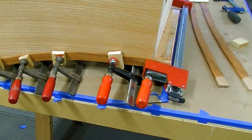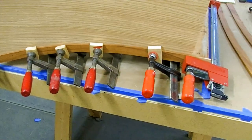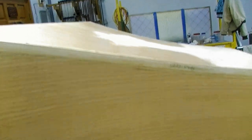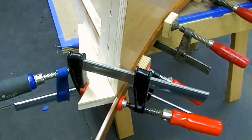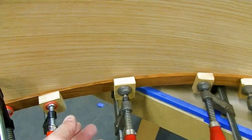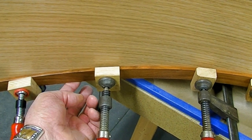After bending this little strip here, like you saw, I'm doing a dry fit with just clamps, no glue yet. I'm able to clamp these. The back side I'm able to do because it's hollow and I'm able to get the clamps around this edge. This top part's going to be another story. But to get this end here, I made a little jig out of plywood. Clamp that onto the frame here, and then I can get that last little edge there. So this ought to work pretty good, and I've got a little bit of overhang. So when I'm all done, I'll put the altar upright and then use a spoke shave to clean that up and make it flush.